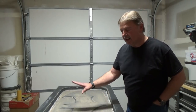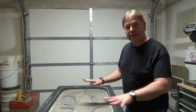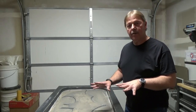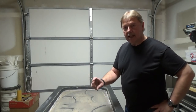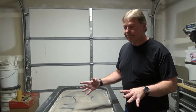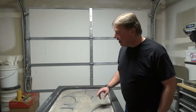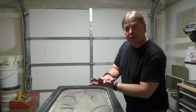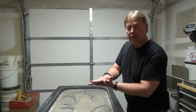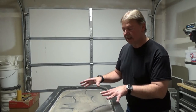My plan is to repair the damage — pull some more putty, get my fillets back to shape, get the surface nice and smooth, and primer coat to make sure it's nice and flat. Then we will use a product called PVA, which is a polyvinyl alcohol. You basically mist it on and build up a layer, sort of like a saran wrap — a liquid saran wrap applied in our mold. When we gel coat and laminate, it will create a barrier between the primer coat and the gel coat so there's no chance of sticking.